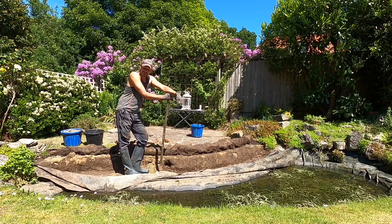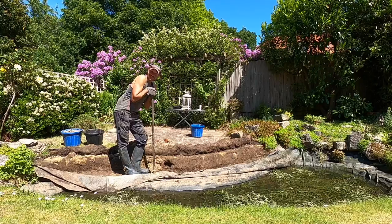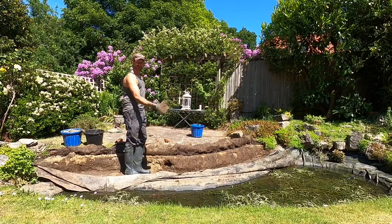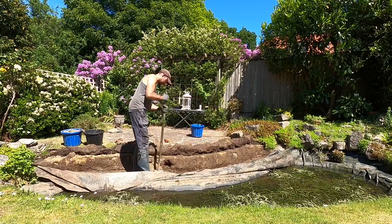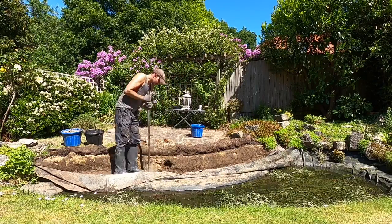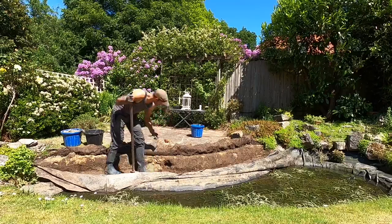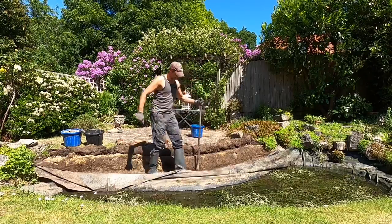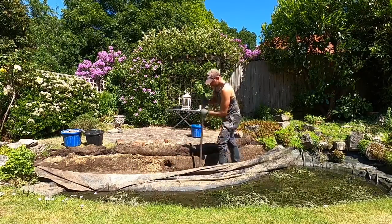I've been to get the rock and the cement and other materials, so I'm now just tamping over the shelf to make sure I firm down the ground — nice and solid, knocking down any imperfections and stones — just using a little tarmac tamp like this. The ground is lovely and sandy and soft here so it's a nice material to work with and there are very few sharp objects, but it's worth going over and doing this. I can assure you that if you don't, when you lay the liner back over you can always feel something sharp poking through and then you have to take it all apart again. So preparation is always key — get the basics right and get the first bit done right and everything else is a lot easier.